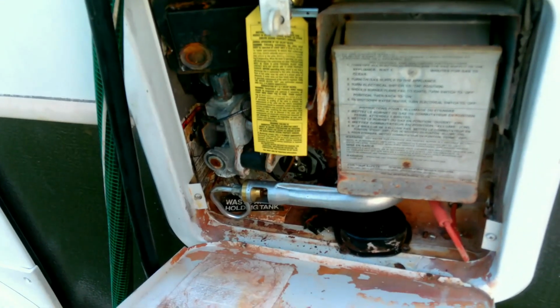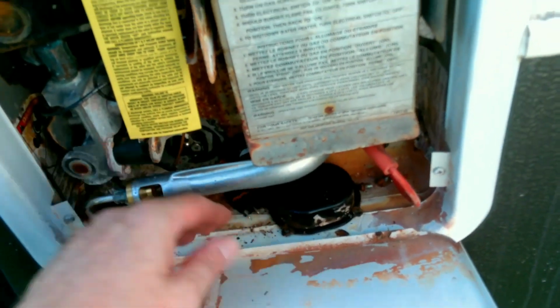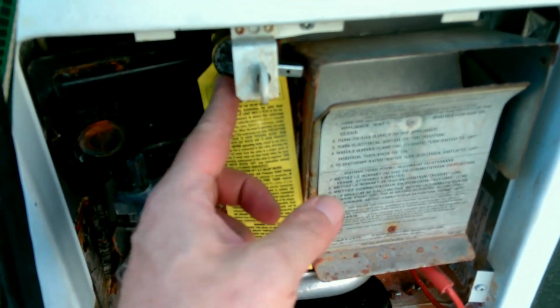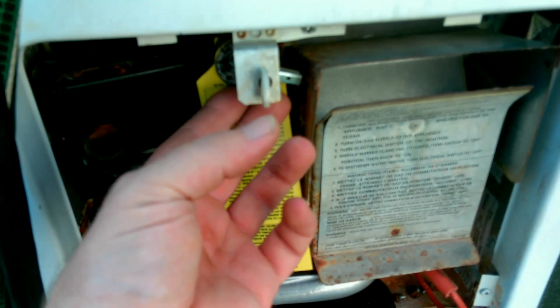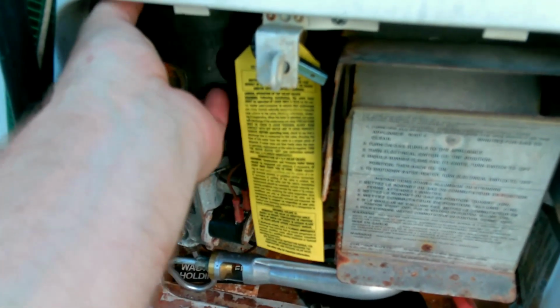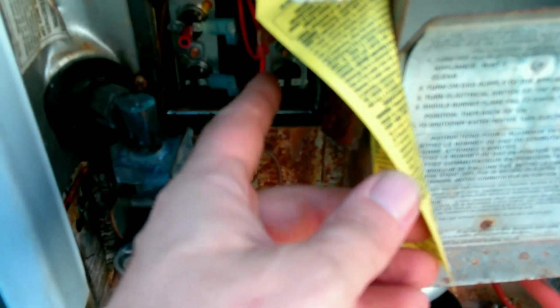All right, so that didn't work. The pressure relief valve started leaking. It says at 210 Fahrenheit, it's gonna leak. So I pulled this cap off from here and I've ordered both of these new thermostats because for some reason they're not shutting down.